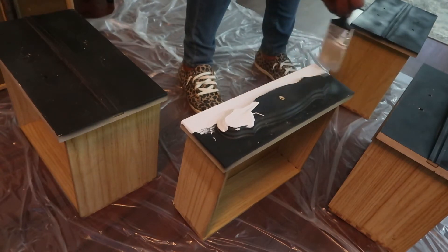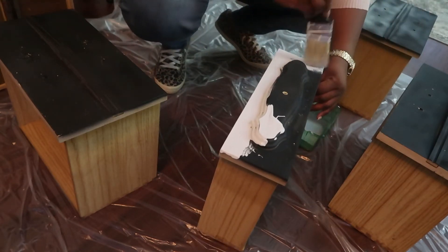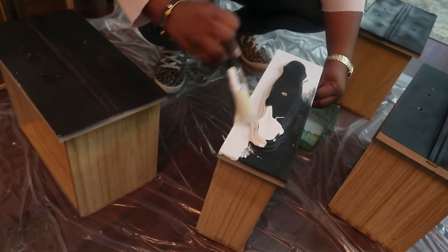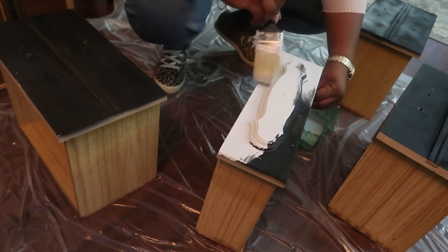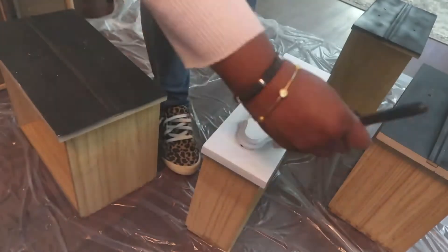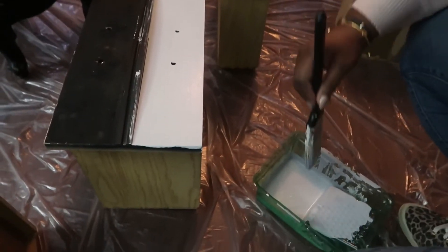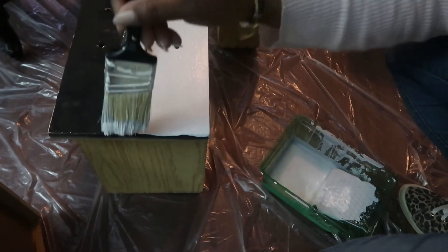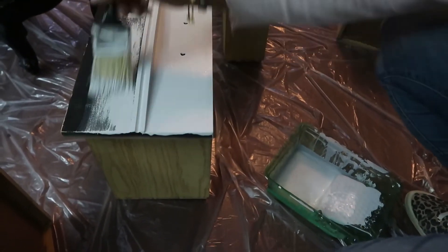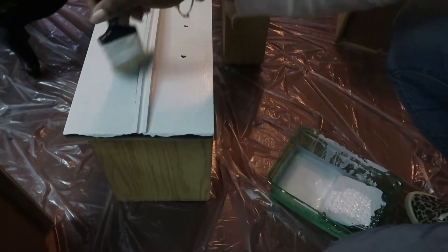Another great thing about this chalk paint — I did not prime anything. I didn't do anything to prep these drawers or the unit outside of just giving it a good wipe down with soap and water. One coat just takes away the black, and that is like a thick coat of spray paint — almost two coats that have been on there for years — and one coat just takes it away. It acts as a primer. For these drawers, I gave them two good coats and touched up any spaces that needed it. The drying time was not long at all; after two coats on the drawers I was able to move on to the dresser, and everything was pretty much dry to the touch within about an hour.